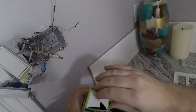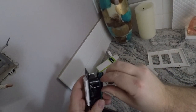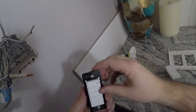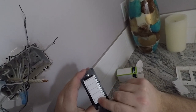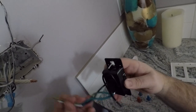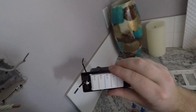So next up, open up our box. You can follow the instructions if you need, but I'll show you how to do it here. These are the Leviton DT-130 — a really nice looking timer. You've got a 5-minute, a 10-minute, a 15-minute, and a 30-minute setting. These work with bath fans, they work with lights, with just motors — like if you want it on a pump, this will work on anything.